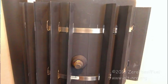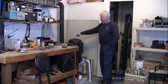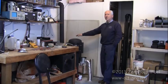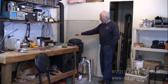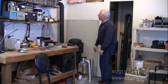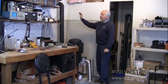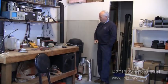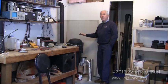By adding these fins, whereas I was able at one point to get the top of this tank as hot as 700 degrees, now I have a very difficult time getting the top of this tank any hotter than 500 degrees Fahrenheit. Typical operating temperatures are somewhere in the mid 400s for the top of the tank, and the rest of the heat is being dissipated by these fins before it can get further down. Adding the fins also decreased my flue temperatures by 40 degrees across the board, so the heat exchange efficiency of the stove is phenomenal right now. I'm very happy with the way it's performing.